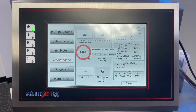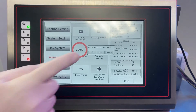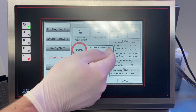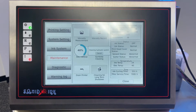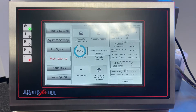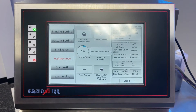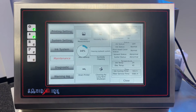When the printer is done adding makeup, you'll see 'Replenishment Accomplished' on the display with the status bar at 100%. Click Continue. This prompts the machine to start cleaning itself out internally. At this point there's not much to do manually — the printer is going to clean itself out and you'll see various processes taking place. This takes several minutes.